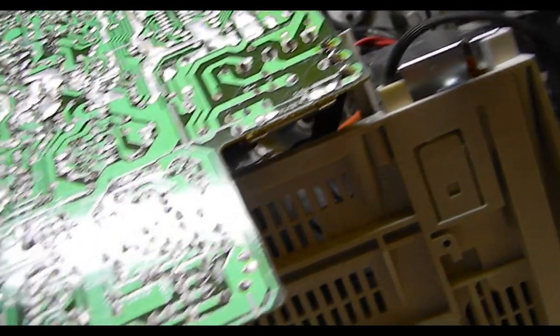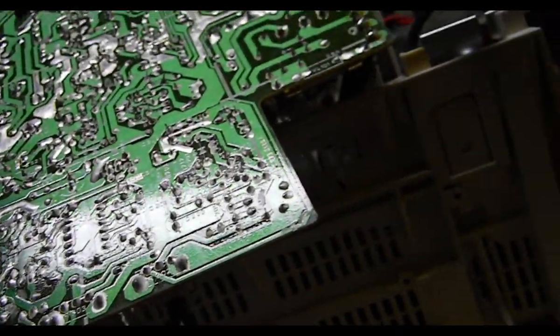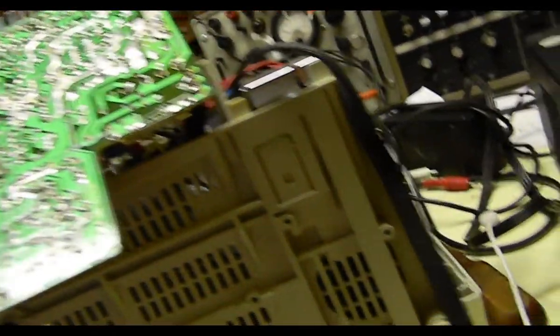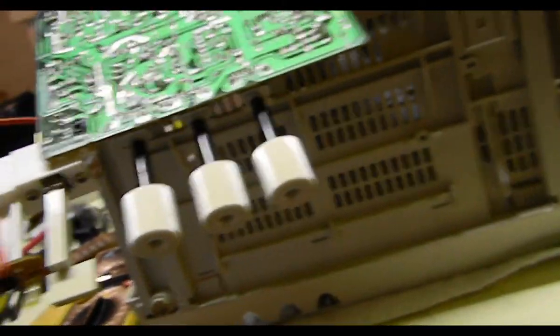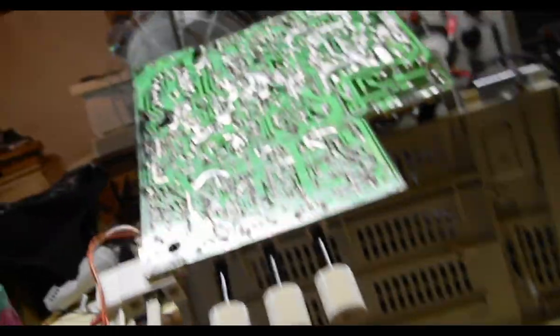After this ordeal this thing doesn't seem to work at all anymore — doesn't even acknowledge when I press the power button, and it doesn't really have an IC in it. Now I've tested for continuity on the fuses between the power line and the traces nearest to where they go, and the power switch — it's good, good, good. Now I'm suspicious of the yoke, because these older sets do not function without the yoke. The yoke is where all the horizontal deflection happens — it'll work out the vertical but won't work out the horizontal. So I'm curious about the yoke now. I'm pretty sure the switch is supposed to break the circuit, and there is no continuity between any terminal on the switch and any of the power lines here.